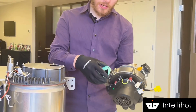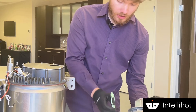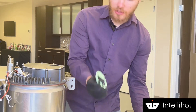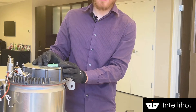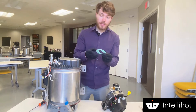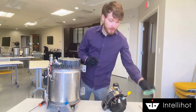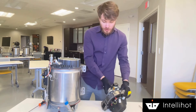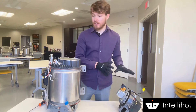You'll note that there is a gasket here that comes off with the blower. This sits on the top of the top cast plate and gets compressed when we tighten the blower on — it's just a seal, so it can go on either way. If you were to ever replace a blower in the field, you actually get one of these in the replacement kit. We're going to leave the blower and gas valve assembly aside for now and take the gas valve assembly off in a second.